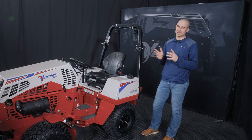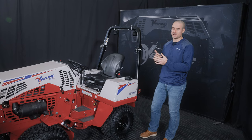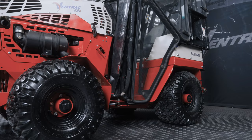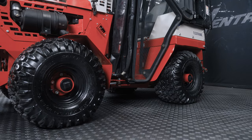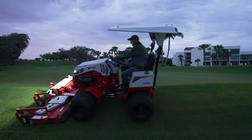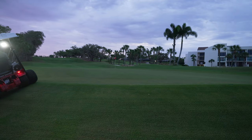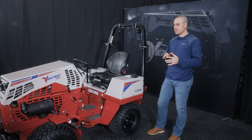You're going to notice that that 16 PSI only really comes into play if you're working with very heavy attachments on the front and/or back end that's making the tires squat too much. Or if you're running a cab and you're working mostly on hard surfaces, and it doesn't matter. But when you're working on turf, and if traction is important to you, then you're going to want to get as close as you possibly can to that low recommendation number. And what that's going to do is improve traction and make the tractor handle a little bit better.